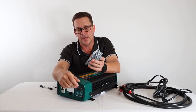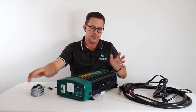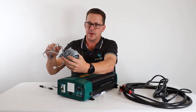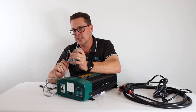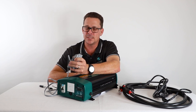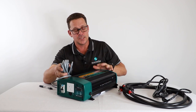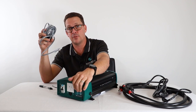Another important installation warning: if you have battery power connected and you need to shorten the remote control cable, do not cut it while DC power is on the inverter. Either completely isolate the inverter from DC power, or at minimum unplug the remote cable from the inverter first. Cutting this cable while it's plugged in with DC power present risks damage to the unit.